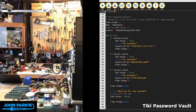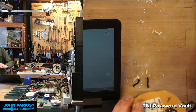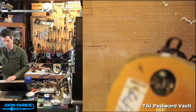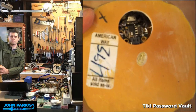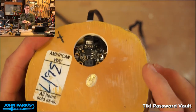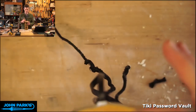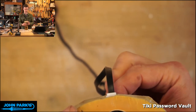All right, let me do this on the down shooter and show you what we're talking about here. Sorry. So, let me zoom in close with the laptop again. And, can I change that? There we go. So this, I don't know how well you can see it, this wire is heading over the top of the USB connector. And that could cause it to get read as a capacitive touch.